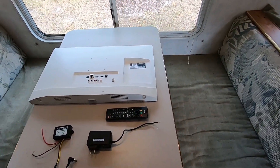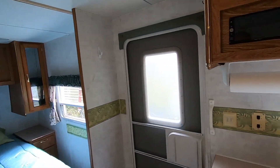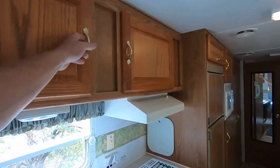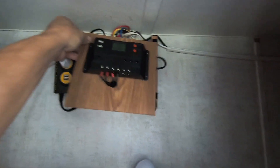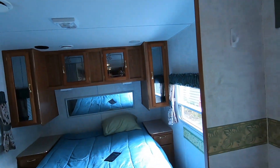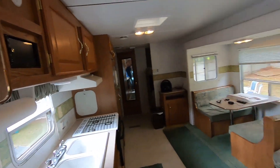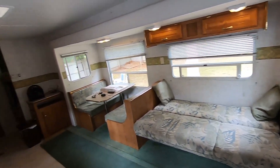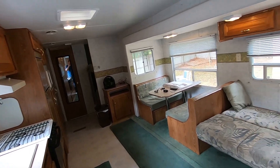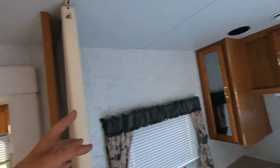I just came across an idea for a TV in a camper. In my quest to be self-sufficient, I've got a basic Harbor Freight solar system set up to recharge the 12-volt system in the camper. I have a 105 amp-hour lead acid battery which gives me about 50 amp-hours of working time. I'm trying to be as sufficient as possible without running the generator, and of course lights and television are the biggest things, along with charging devices, which can all be run off 12 volt.